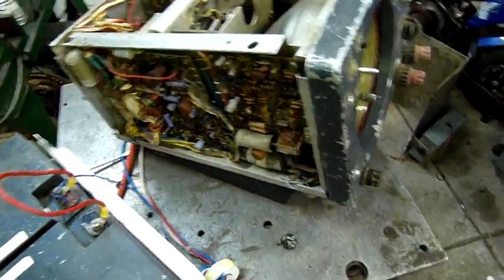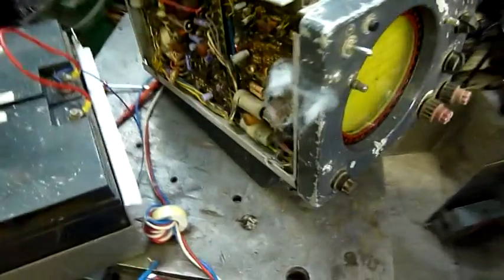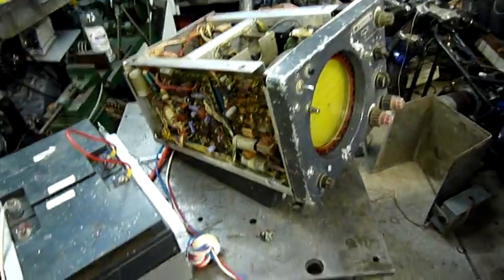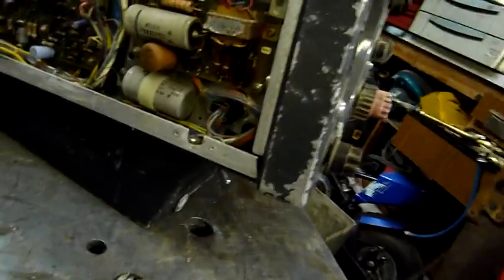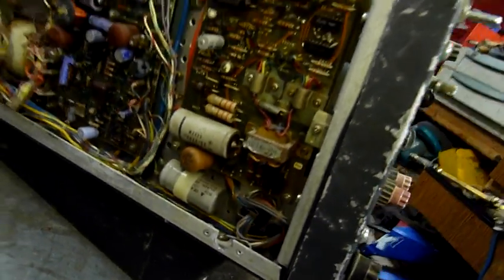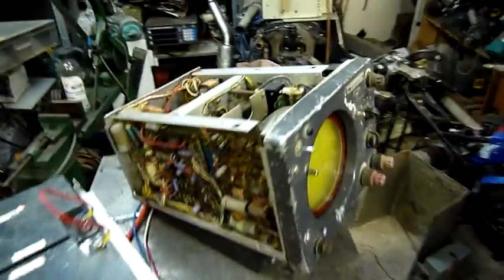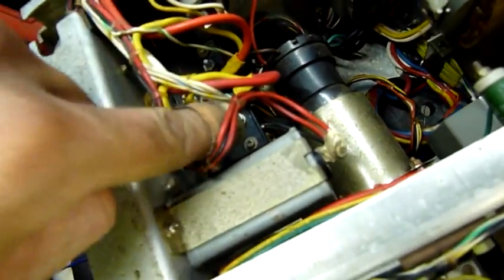I guess I should test this out before I do anything else with it — I know it's got blown caps and resistors. Yeah, it's just finishing off the resistors. Seventies vintage smoke — once you let the magic smoke out of electronics they don't work anymore, which is a shame. So I'm going to have to replace those resistors. They'd be fairly high wattage if they're that chunky, but I think these days you replace them with ceramics. At least we know the magic smoke's going to come out, and I definitely know it's a 24 volt system because the taps on that transformer clearly say it — one is zero, the other is 24 volts. Mains go straight into 24 volt DC and the rest comes out of that big transformer block.